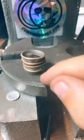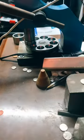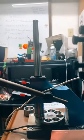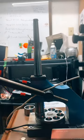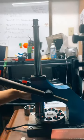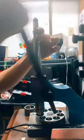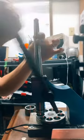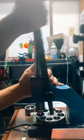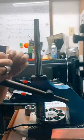So now we're going to go over here to the ring stretcher and stretch these rings out. And while I do this, I cannot see my screen, so if my moderators will pay a little closer attention, I appreciate you guys answering questions. I'm just going to stretch these out a bit. Check what size I'm looking for. This one needs to be a size 13. That's pretty big. So we'll probably hit this one with a torch here in a second. Go ahead and stretch out the rest of these.